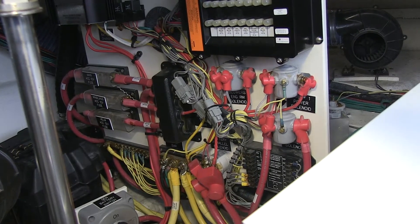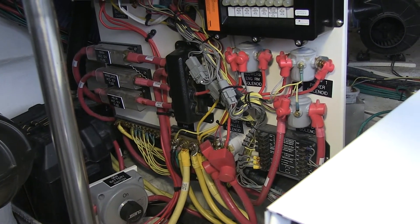In the manual they're always going to show you a diagram showing the cables directly connected to a battery. A lot of people take that as a general recommendation and might start getting creative — maybe the inverter is far away, or closer to the battery switches, or closer to the DC distribution. An installer who didn't really understand the implications might be tempted to connect the inverter directly to the DC distribution, thinking it's convenient and a shorter cable run.